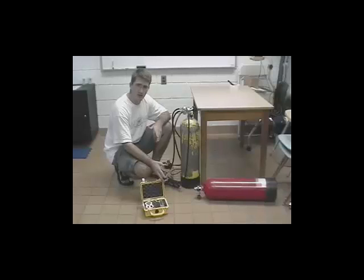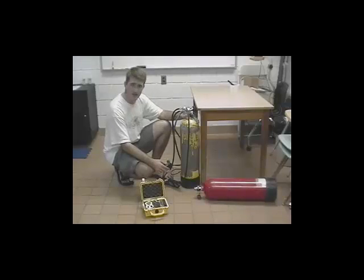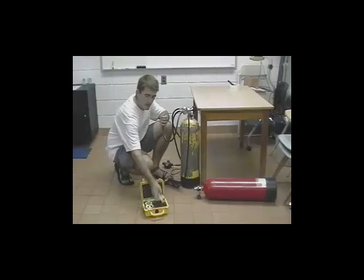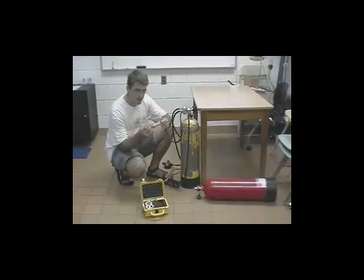The second way to calibrate our oxygen sensor, and what will be a little more accurate for us, is to use a tank that we know has air in it. Here I have my regulator set up on the tank. The air is already turned on. I'm going to use the low pressure inflator hose and connect it to our flow regulator. I'm going to connect this just like I would connect my power inflator.